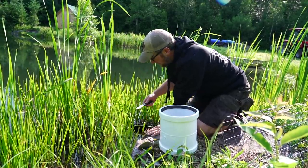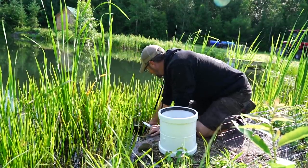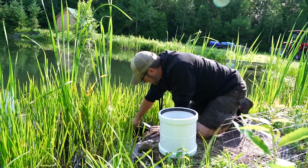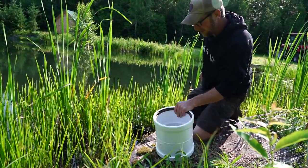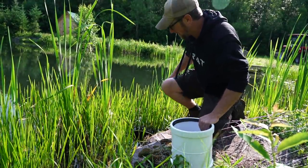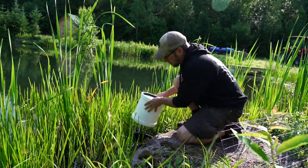The issue I'm having is I really don't know what kind of pipe this is. It's covered in crud. It's actually a metal pipe. So I might have to get a different collar. This one is made for Schedule 35 PVC, and I think the wall of this is thicker, so it's not pushing on. The outside diameter is larger.